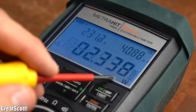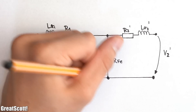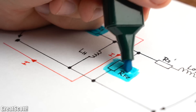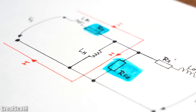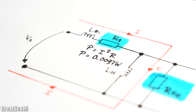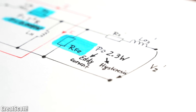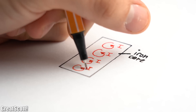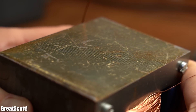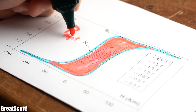The transformer also uses quite a bit of real input power even though there is no load connected at the output. Looking at the equivalent circuit diagram, with no load all current flows through the cross path, and real power losses only occur at two resistances. The first is the copper resistance of the primary coil, which is relatively small. Most power gets wasted through iron losses, which include eddy currents and hysteresis losses. Eddy currents are created by the induction of a voltage into the iron core, and to keep them small, iron cores are built with separated laminated steel sheets. Hysteresis losses occur while the iron core gets alternatingly magnetized and can be spotted in the corresponding BH diagram of the material.